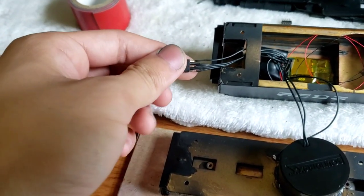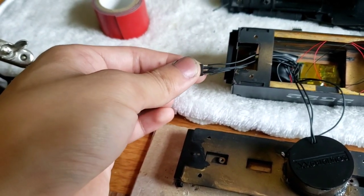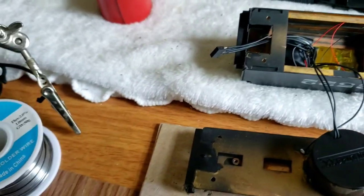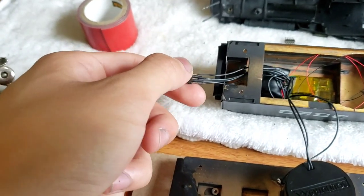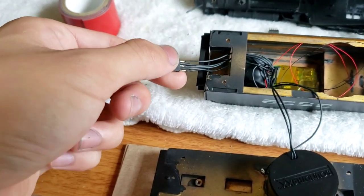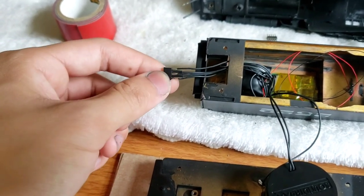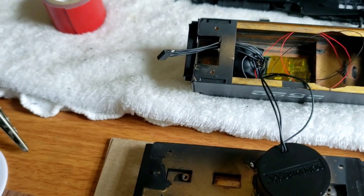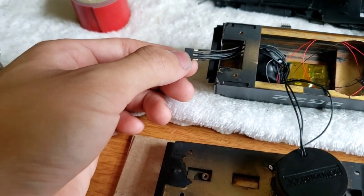I don't have the LED or motor polarity confirmed yet — I have the pickup in the middle. The idea behind this is if I wire the motor or LED backwards, I can just simply flip the plug backwards and everything is in the correct polarity. I'll actually have a second plug in the engine, so if the LED or motor needs flipping I can use the other plug. The two outer wires are LED, the two inner ones are motor wires, and the one in the really middle is pickup — so it's symmetrical. If I accidentally plug it in backwards, it won't burn out the decoder.